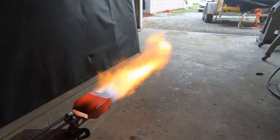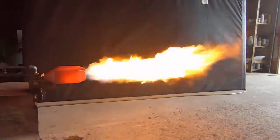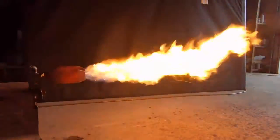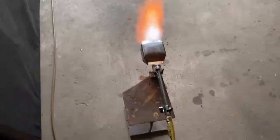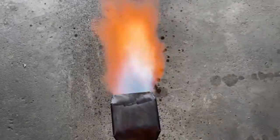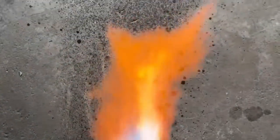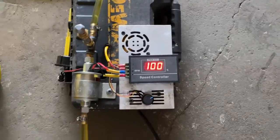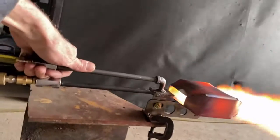This thing is working out great. However, that phenomenon we observed — where subsonic flow causes a predominant flow to the right or left side of the nozzle — it doesn't really show itself prominently on high fuel flow. But at low fuel flow, or high air flow, anytime the fuel entrainment is low, you get that predominant right-side flame.